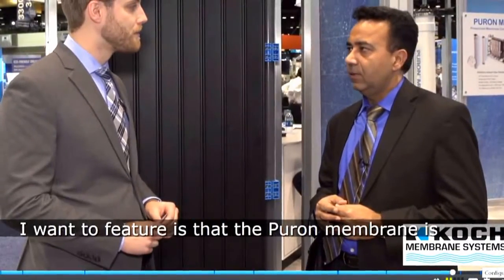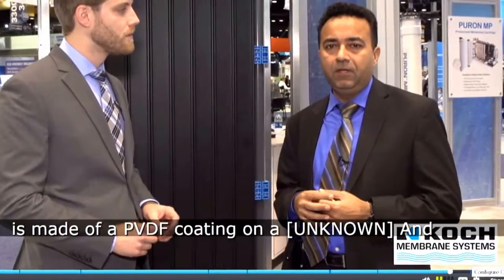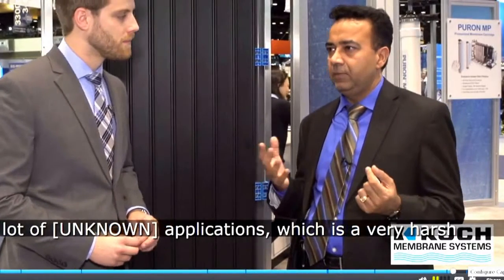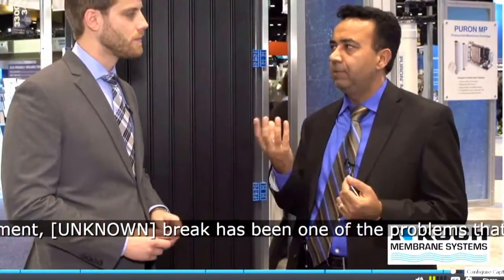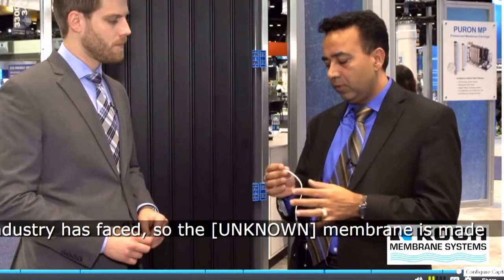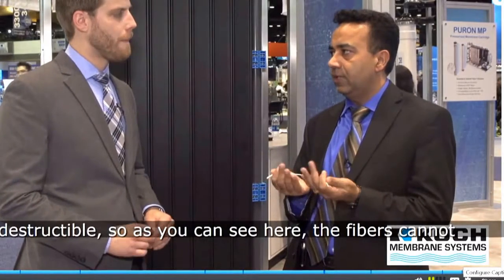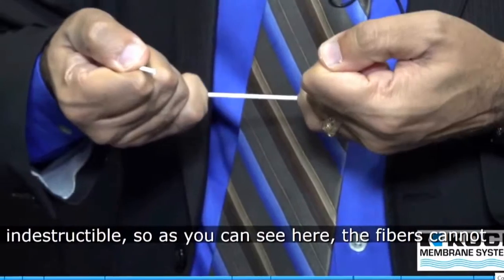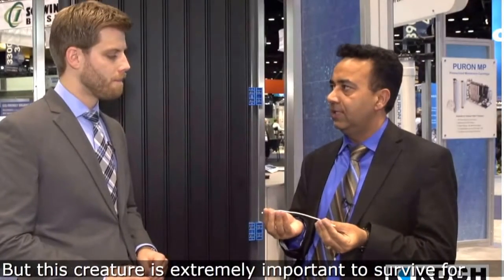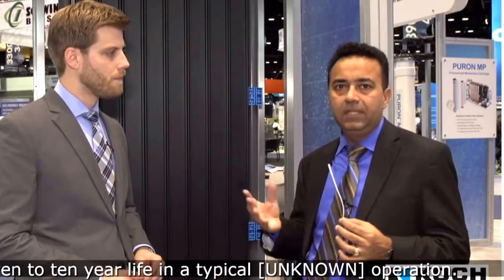Yes, one thing I want to add is that the Puron membrane is made of a PVDF coating on a braid. And in a lot of MBR applications, which is a very harsh environment, fiber break has been one of the problems that the industry has faced. So the Puron membrane is made of PVDF coating on a braid, which makes it virtually indestructible. So as you can see here, the fibers cannot be broken. And there is a unique technology that goes behind this. But this feature is extremely important to survive a 7 to 10 year life in a typical MBR operation.